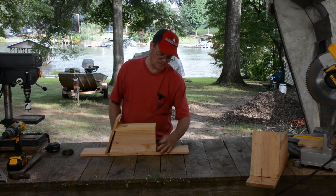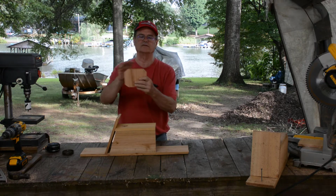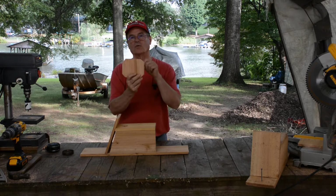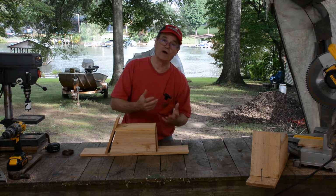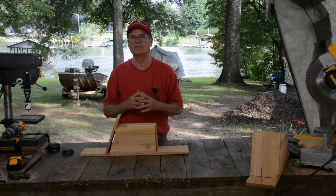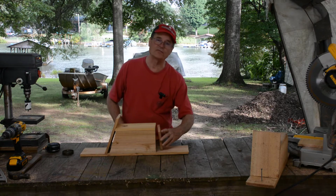Now, when I cut the picket, if you notice, the top of the picket had 2 ears cut off. I guess it was like this. These were the cuts. When you cut the bottom, cut the other 2 corners out. Now the reason you do that is so there's airflow up through the bottom. You need airflow so that moisture doesn't build up. If rainwater happens to get in there, it's got plenty of place to get out. But you need airflow in there.